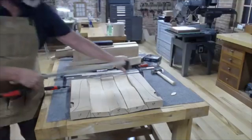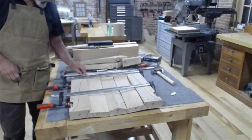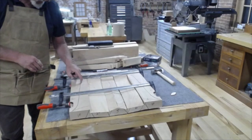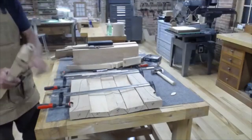As I mentioned before, when you're clamping, be very conscious of this piece right here. If your joinery is not good, not tight, those 2-3 degree bevels that complement each other, if they're not good and you force this, you get a crack right down here. No recovery from that. So, back legs first, right?